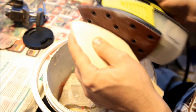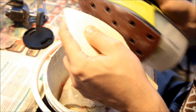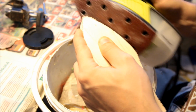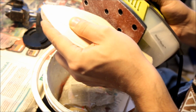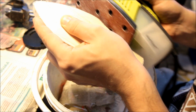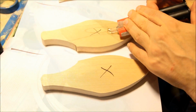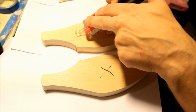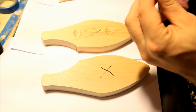After I cut the two halves, I then sanded them as close to being identical as I saw being needed, which is pretty close. I didn't see any need to be super accurate here because more likely than not I'm going to have to sand them again after the joining. Then I just mixed some 5-minute epoxy, smeared it on the other half and then just clamped them together.